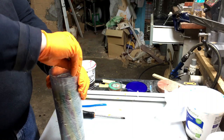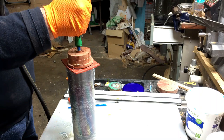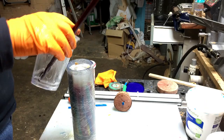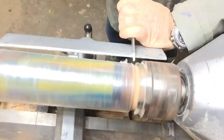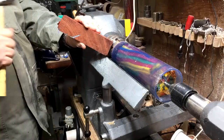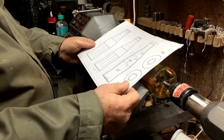I've got two challenges here: I need the front of them more toward the center, so I made three wedges. I also want to take out all the bubbles, so I made a quick vacuum using a Venturi system and pulled out most of the air bubbles — I think all of them. By the way, that's also how I take off hot glue gun glue, the easiest way. Now I'll see if it came out right or if it's full of bubbles — and I think there are no bubbles.